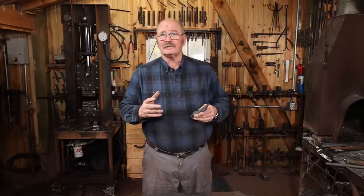What I really think happened is just bad timing on my part. What I mean by bad timing is you should temper immediately after quenching. I didn't do that. I decided, well, let's do some hardness testing. So I set this on the anvil. I moved cameras around to show what I was doing with the hardness files, went and got the hardness files, then moved cameras around so I could talk to you just like I'm doing now about what I had just done with the hardness files. And it was a good 15 or 20 minutes before this went into the tempering oven.